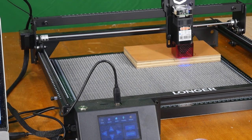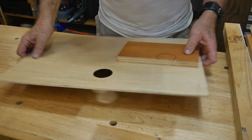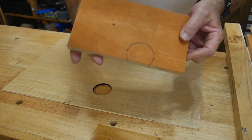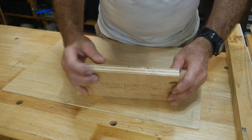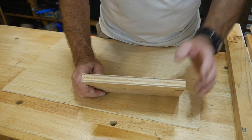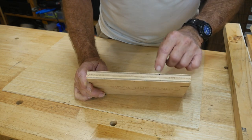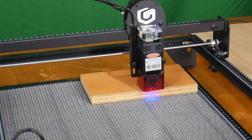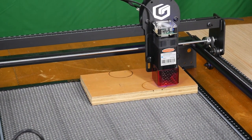The quarter-inch plywood was cut out and made a nice little hole, but the circle we made on the three-quarter-inch board at 100 cycles and 100% power — there's the depth — it's about a quarter of an inch. So we have a benchmark at that point. But what if I keep the laser going and say let's go 500 cycles?